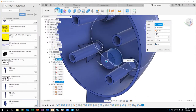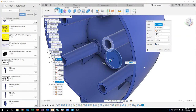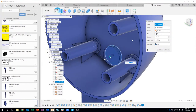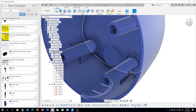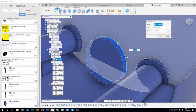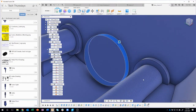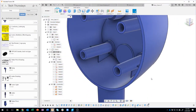And I want to basically offset this, I want it to go to the height of the short standoff. I knew, there we go. I'm going to click on that short standoff there. This is why I create notes, so I knew the exact distance. So you can see in this case it's 0.15. So we use that circle. We're adding some material in here, okay? And then I'm actually going to add even more material. So I'm going to click on this face here, say press pull, and we're going to add 0.1 to make that a much larger shape. Okay? And this will make more sense here in a moment. It's kind of hard to see inside the model, so I won't show it on the video.